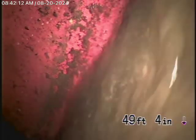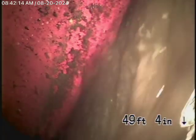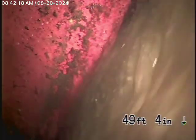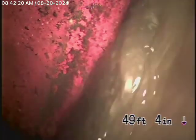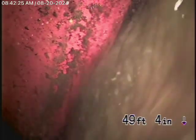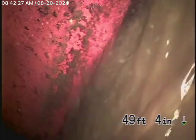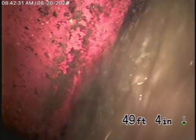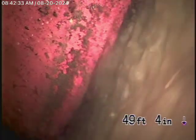Everything was very clean except right at the connection of the 4-inch ABS clean-out to the 4-inch ABS pipe, where there were roots getting into the coupling. The homeowner gave us permission to hydrojet the line, we've cleaned it out, and we have our camera in the line all the way out to the city connection in the street — you can see the city sewer flowing by over there.